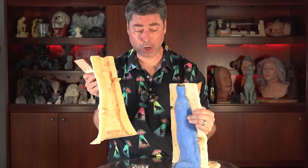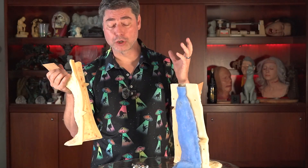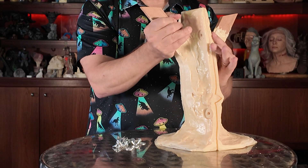Once we've poured our silicone over our part into that support shell, we now have our finished mold. We take everything apart, strip the silicone off the original master, and we have a mold ready for casting. There are a lot of advantages to a matrix mold over a brush-on or block mold. This method does require more labor than a block mold — about even with a brush-on mold — but the main benefit is this allows the mold to be remade over and over. When we wear out the silicone mold inside, we throw away that silicone, put the support shell around the original master, pour more silicone, and we have another mold ready for production. This type of technique is ideal for production casting.